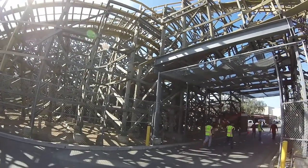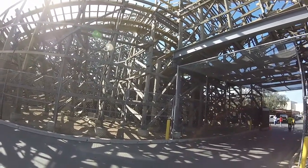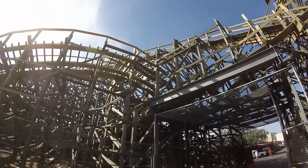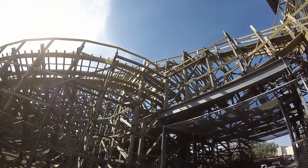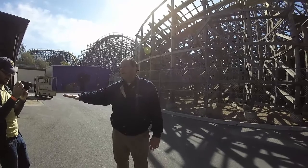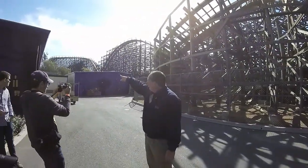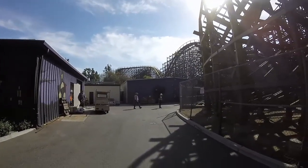Right here above the steel beam just to the left, you can see the high banking — and that banking you see used to be a flatter area on this ride. You can see where the clamps are: there's a ledger going straight across and then off that same ledger you see an angled one. The one going flat across was the old location; the new one is on an angle — that's how much we've changed it and done the banking on the ride. It's like freeway interchanges: if they were completely flat you'd be thrown against the side door, but by banking them just like overpasses, it's a more comfortable ride. We've done that on almost all of our turns — whether it's the helix here or out on Beach Boulevard — you can actually see it's more on a bank.